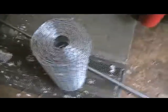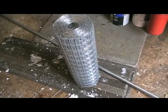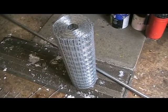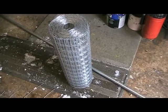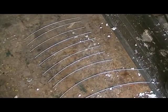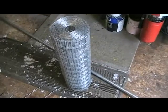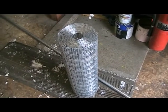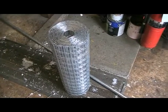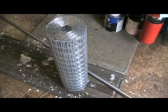Then you're going to use some cage wire. You don't have to have a reflector on this antenna, but a reflector does a very good job of enhancing and amplifying the signal. We're going to use cage wire to make the reflector. You can use tin foil if you want — if you're putting it on a piece of plywood in the attic where it doesn't show. You could also use coat hangers, field fence, chicken wire, or a screen door screen — as long as it's not plastic or fiberglass. It has to be aluminum or metal of some sort.